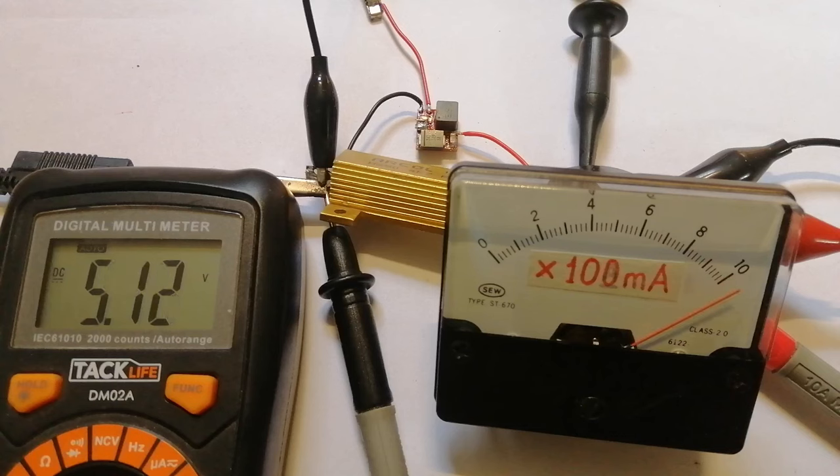Keep in mind the measurements aren't perfect. The last test is to see if it can actually deliver 10 watts on the output, so I need to draw at least 2 amps and see if it doesn't shut down — and it looks like it's doing that perfectly well. I'm really happy with it in the end, even though I screwed up the footprint and the first version had that problem. I'll probably upload the Gerber files in the future, but not right away because I want to correct the wrong footprint first. Thanks everyone for watching — hopefully you found it entertaining and informative, and I'll see you in the next one.